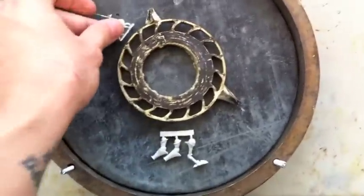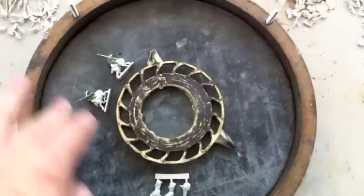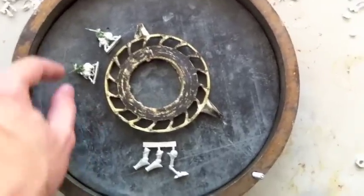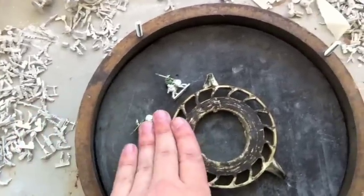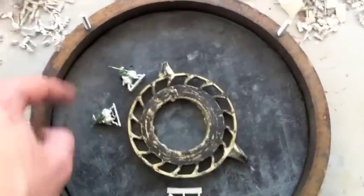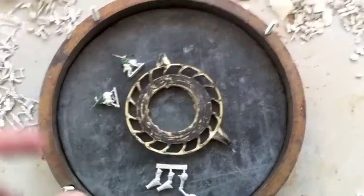In this next step I'm going to lay out these figures. Some of them are going to require me to cut into the mold blank, and that's to support bits. Like you can see, these have spear shafts that are sort of riding above the plane of the mold, so when I squeeze this thing together I don't want those to bend. I'll build up a little bit of mold underneath it by cutting from somewhere else. And then I'll put the acorn nuts.